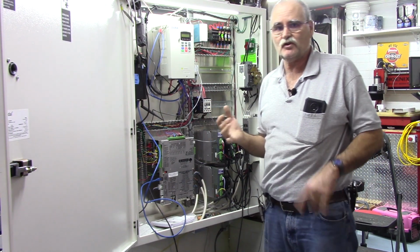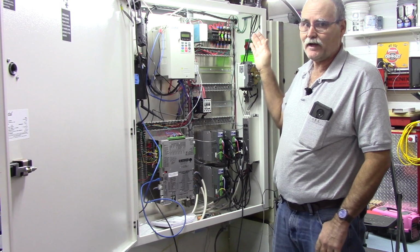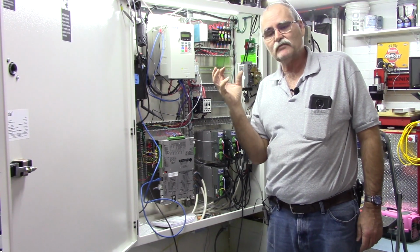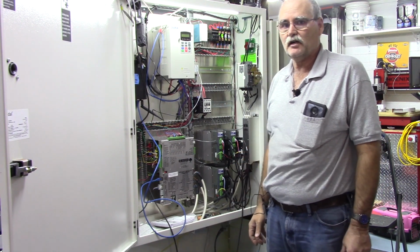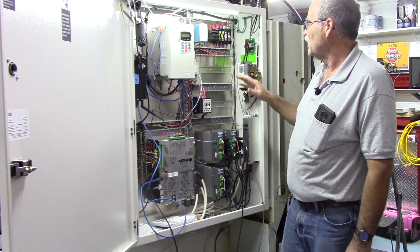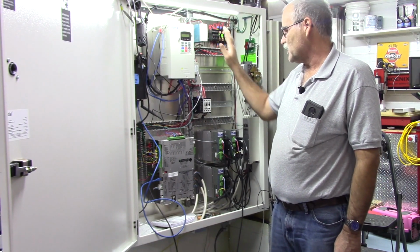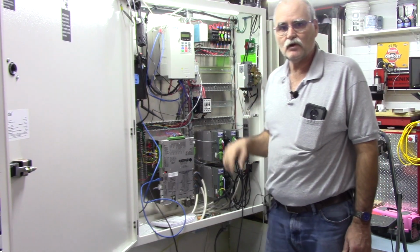The reason for a brake on the Z-axis on this particular machine, and actually any machines in general that have a ball screw and linear ways, is that they can fall without that brake. So you can't really put any kind of motor up there without some sort of axis brake to hold that Z in position when the servo motor is not energized and holding. So that's the reason behind a brake. I'll pan you up there in a second. I have a separate 24 volt DC power supply for that brake. It's not part of the logic to Oak. It's separate.